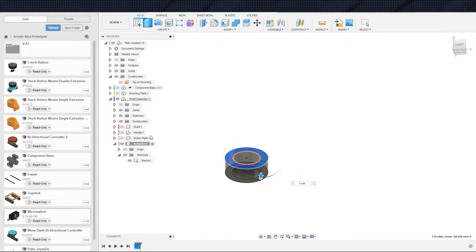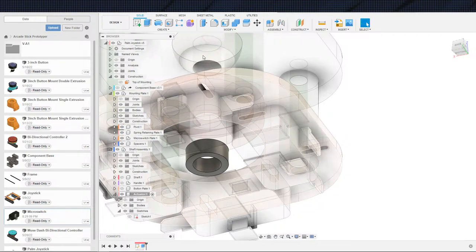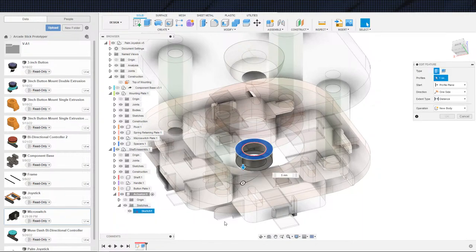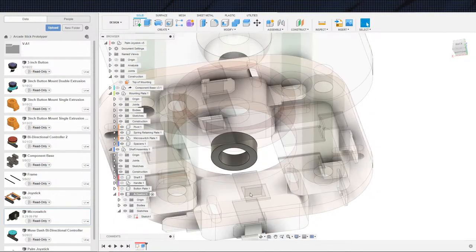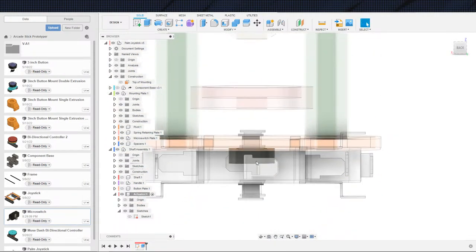Let me take a quick look at the mounting of the micro switches on the mounting plate. Yeah, okay, that is not the same size as the micro switches on the mounting plate, which is what I wanted. I wanted it to be smaller. Those are about 9, so actually I'm going to back up and make this 4 instead, so that we have even more room to adjust up and down within the range of the micro switches. And how this stays on there is a little bit skeptical.